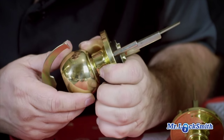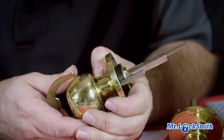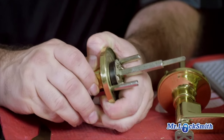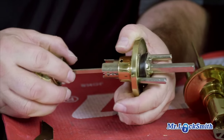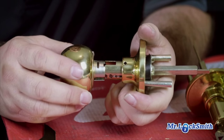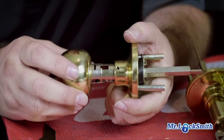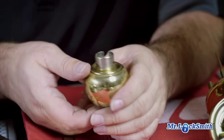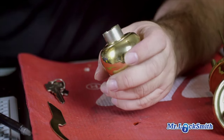I'm doing this upside down and backwards. Depress the pin and try to pull it off at the same time. So: depress it, rotate it, depress it, pull it off — then we can get at the cylinder for re-keying it.